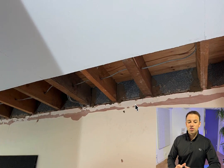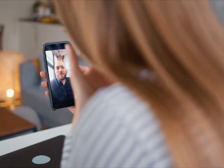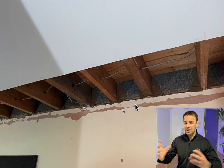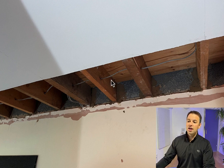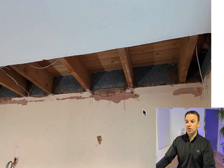For those of you that are hearing clear conversation, or maybe some of you hearing a TV presenter's voice, or maybe your neighbours on FaceTime, if you're hearing the actual person they're on the phone to, that's high frequency. That high frequency struggles to come through bricks and mortar, and that would signal you have holes in the structure. So always cut open the ceiling and cut open the floor for those that you have suspended floor voids, and check for those holes.